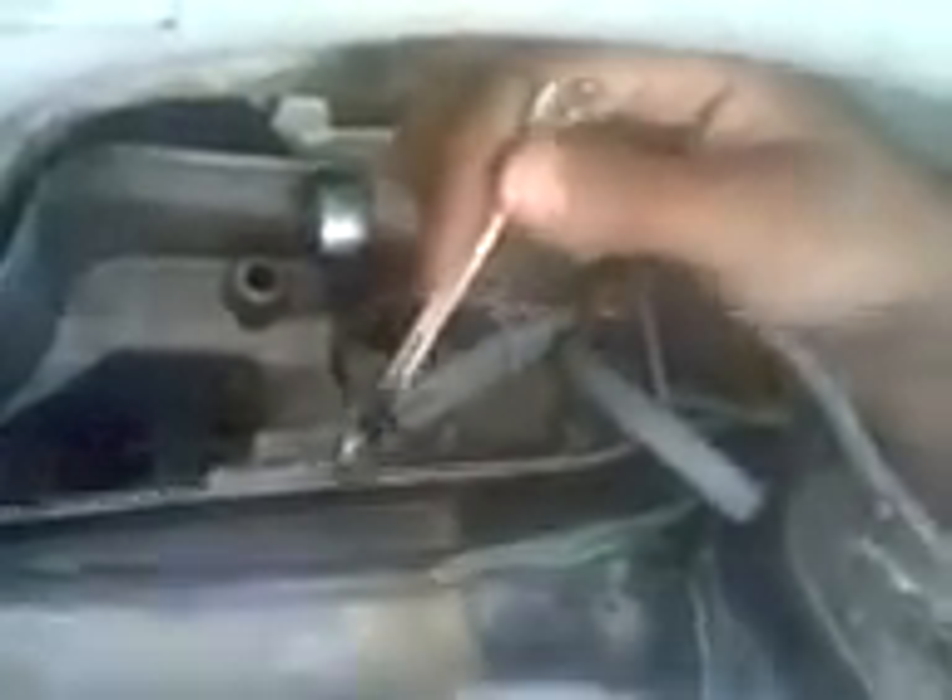This pipe coming from the gasifier controls the gas output and provides it to the engine. The smaller-radius pipe senses the vacuum from the engine and sends the signal to the gasifier. The second smaller pipe controls the 2T oil supply to the engine based on the vacuum and pressure created inside the engine. The flow of 2T oil can also be controlled with solenoid valves. These are the connecting pipes between the gasifier, cylinder, and engine carburetor, running through a channel from one side to the engine.